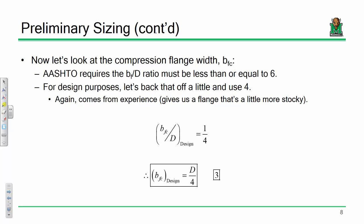Okay? If you look at stiffeners in highway bridges, the ones that aren't connected to cross frames, you will find that they are near the abutments or near the piers. And the reason why is, look at your shear diagram. Your shears around the abutments and the piers go through the roof, okay? And the main body of the span probably won't see other than where they're connecting cross frames. That's a good question. That's a really good question.